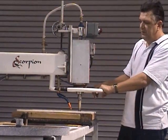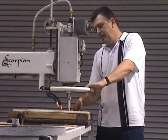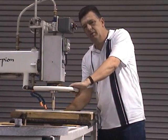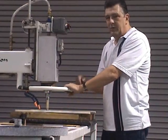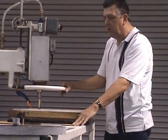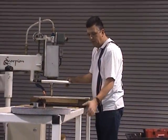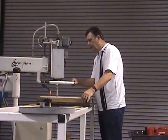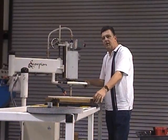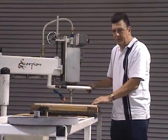Another secret of cutting the sink out is use a solid surface on the bottom to stop blowouts if you're only cutting out sinks. If you're using it to polish, you have to use the two by four. Never, ever, ever clamp to the frame — only clamp to the two by four. Another way of eliminating blowout is to use an acrylic penetrator where you're going to cut the sink. That stops a lot of the blowout.